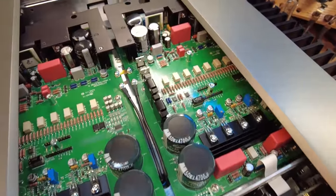Looking at the literature, there's a great image of the internal skeleton — super heavy-gauge aluminum to which everything is mounted: the toroidal transformer, all the heat sinks, and circuit boards. The ethernet port comes in from the back and jumps via cable to the front of the unit. I imagine all the logic and the noisier digital bits are housed in the front panel, which is a great design idea.